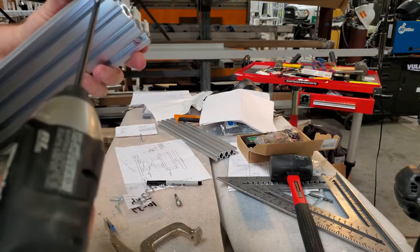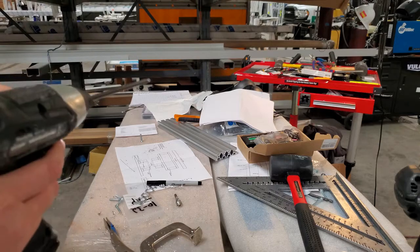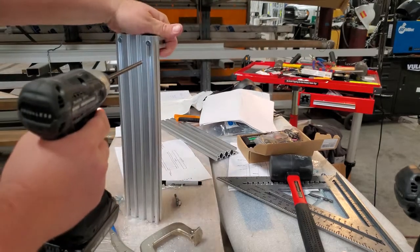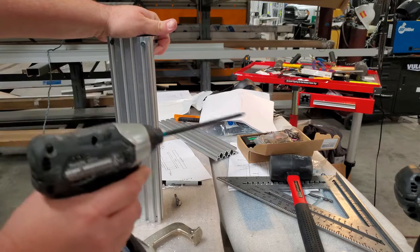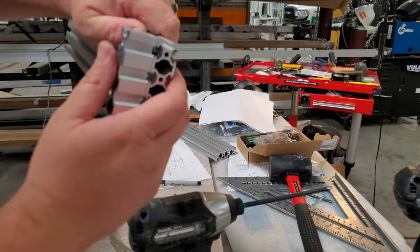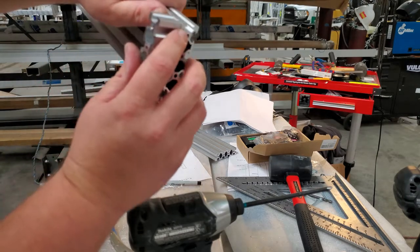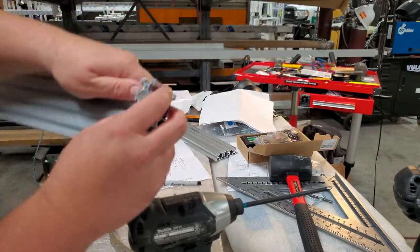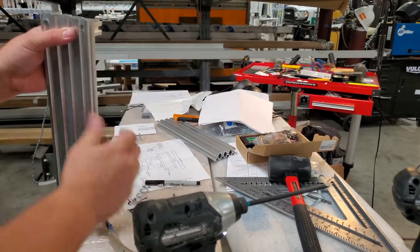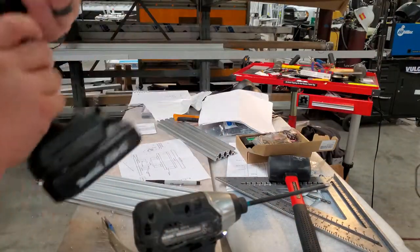Now I'm going to want to watch my corner right there, get everything lined up. Go ahead and pull it a little bit tight, go to my other side. This one's going to need a real jog — I'll actually show you. For whatever reason — I think I did this by hand before I made this jig — I'm off about 1/32 here, and that's not going to work. I want it to be flat. So if you have that issue, you take your screw back out, find a bigger drill bit. I'm going to go all the way through with a quarter inch just to make sure I give myself enough room.